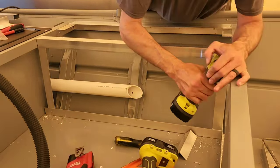I'll tell you what, it's always something. I had to modify a barbed through hole fitting by cutting it so it can accept a 90 degree threaded fitting to attach a hose to for the recess tray drain. This would kick water out the side of the compartment into the channels underneath the rod tubes and subfloor. I mounted the seat base in the back with bolts through the framing, and then I mounted the seat base up front inside of the hatch lid. It had been a lot of hours and work to get to this point, but the boat was now almost ready for the custom routered sea deck turf.